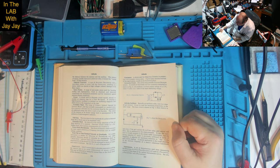Excitation band, fall time, forbidden band, an interval in the energy spectrum of the orbital electrons of a material. Electrons cannot reside in a forbidden band, but in certain circumstances can traverse it. Foster-Seeley discriminator, four-pole or four-terminal network or quadrupole, gated AGC, an AGC system used in television receivers enabling the receiver gain to be varied independently of picture content,